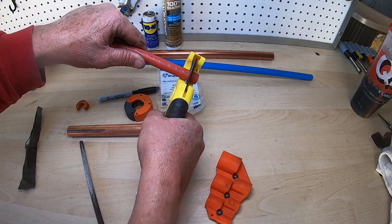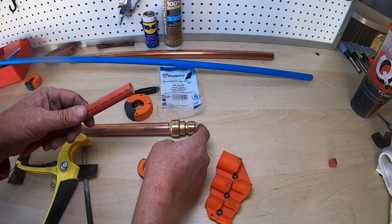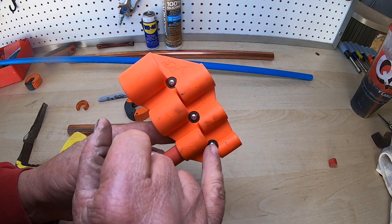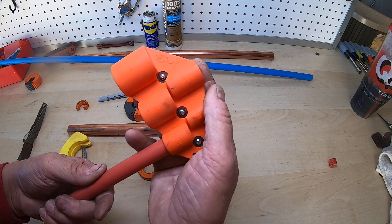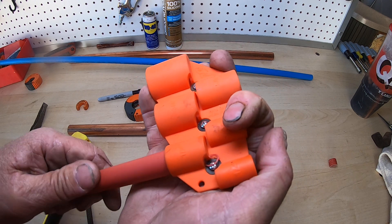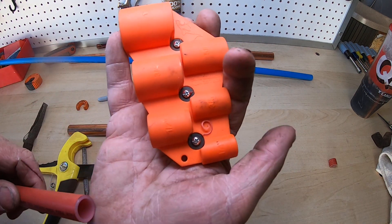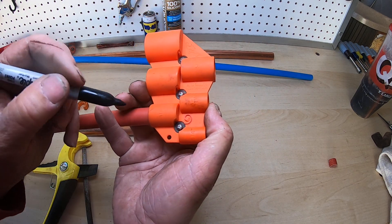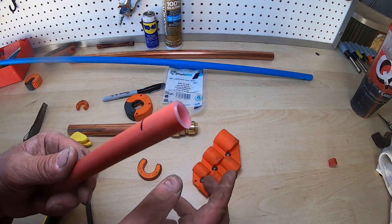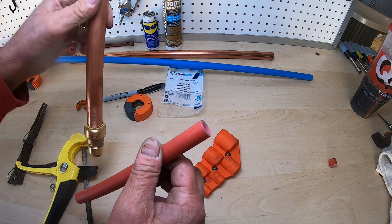We're just going to cut a little bit off and you can see how it cuts. Because the edge that was just cut is sharp and can ruin the SharkBite fitting, you're going to use that same gauge tool again and find this size. It slides in there — right here you've got three cutters for the different sizes. You're going to twist the PEX clockwise, and what it's doing is taking off that little burr right there. You can see the little burr it just took off. Keep the piece in there and use your sharpie again to mark it, so you know how far to push it in. You can see where it's white at the edge — that's where it took off the material so that when you put it all together, it works correctly.